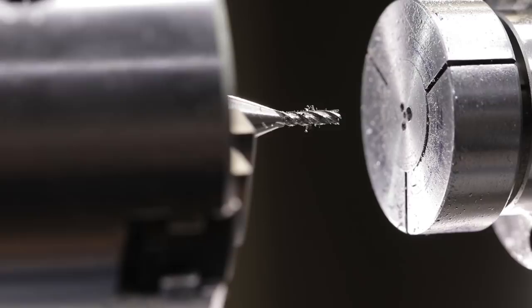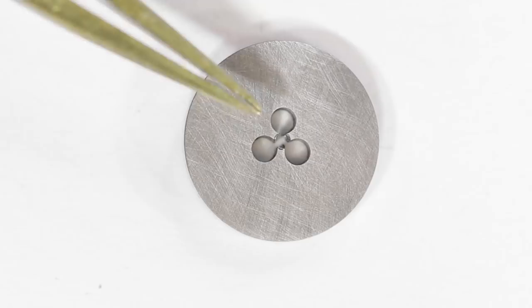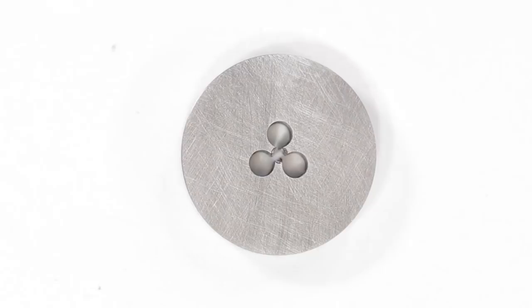So this is what the die looks like at the moment. There was a thin bit of material left around the center hole, as these three holes didn't quite break through. It was very thin. I used the jeweler saw to make the small incisions, and I cleaned the burr up with a fine rat tail needle file, and just ran the surfaces over some 1200 grit emery paper.